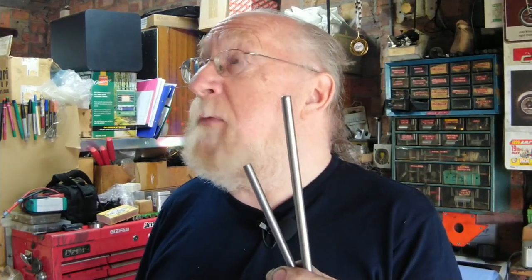There we go — that's the untreated end, and there's the radius end. A nice radius, so it'll just slip in and out of the hole quite nicely. We've achieved the bush repair, and we've achieved these two tommy bars — that's not bad. That's taken me about three hours, this little lot. It wouldn't have taken so long if I hadn't been videoing it, funnily enough. I'll be taking those in Monday, or I might pop into the Heritage Centre on Saturday. I know I've also got a bearing going on one of the lathes in the back that I've got to sort.